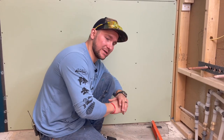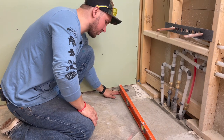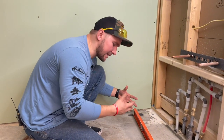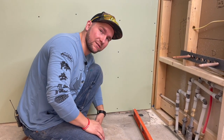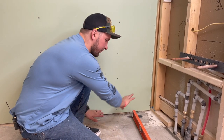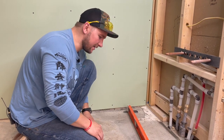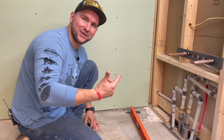In this video, I'm going to show you everything you need to know on how to self-level over a concrete slab. We're getting ready to tile, but we have a massive drop-off — this is not something you can fix with thinset or anything like that. So we have to get a couple of buckets of self-leveling in here. I'm going to show you some cool tricks on how to dam off your sides to make sure there's an expansion gap. Let's get into it.